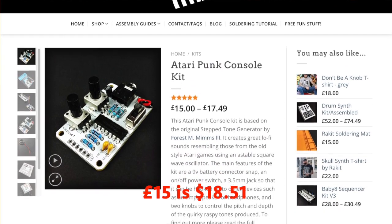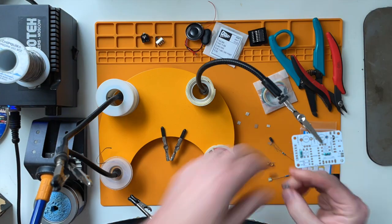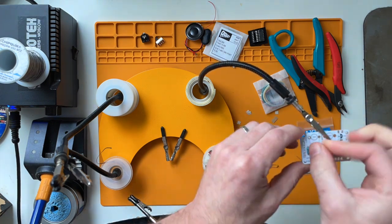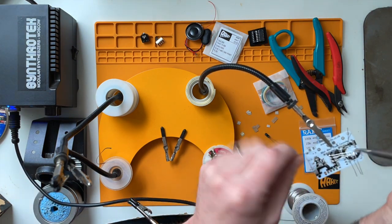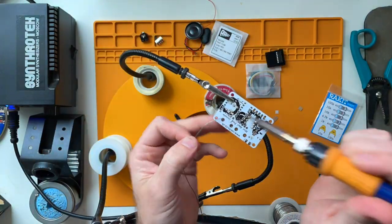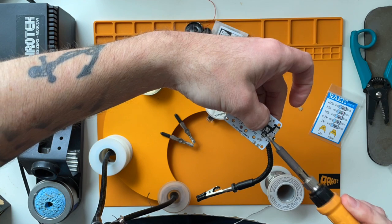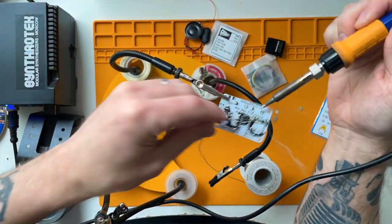First up, let's take a look at the mini APC. I'll put a video on the screen of me building it, but this was an extremely simple build. An APC is a concept that's been around — it's basically two 555 oscillators. They actually use a 556 chip, but a 556 chip is effectively just two 555s. You've got two pots to control the way the oscillators beat against each other, a stereo output jack, a power switch, and about six resistors and three capacitors. Very, very simple circuit — I think it took me less than 15 minutes to build.